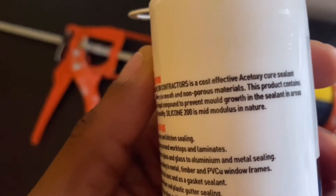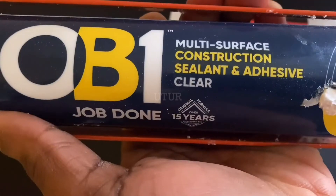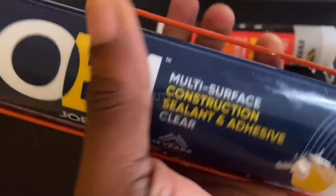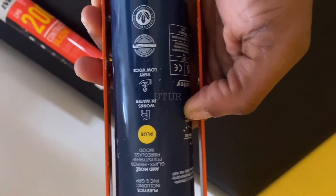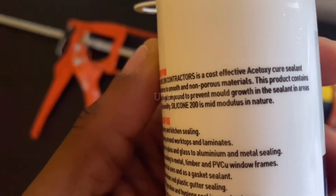Based on that information, I would presume that the OB1 is a neutral cure. Low Modulus Glazing Sealants can be used to provide strong adhesion to glass and cure to provide a clear finish. They can seal around glass edges, windows and doors, embed and glaze panels, and transfer the structural load from glass to the surrounding support system. The OB1 doesn't state if it's high or low modulus, but being odorless connotes neutral cure, so I'd be more inclined to use the OB1.